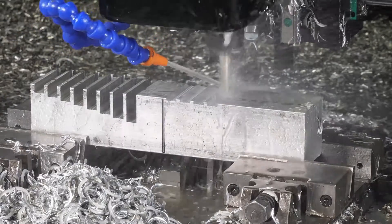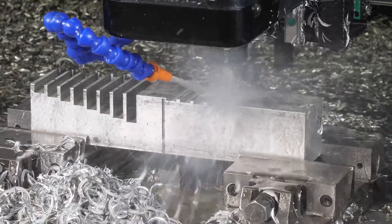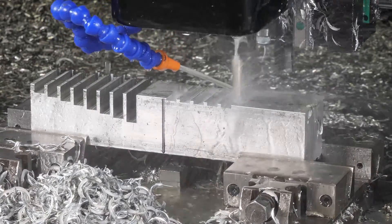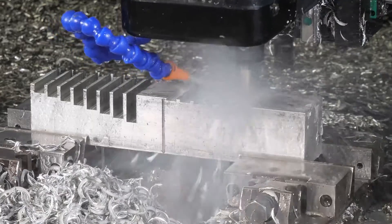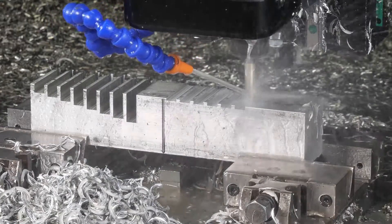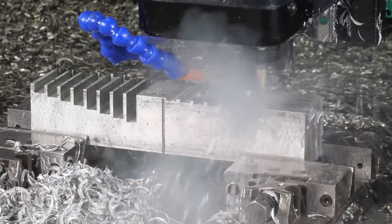For this video I wanted to compare two different machining strategies for slotting. In the first set of cuts, I wanted to go with the more traditional approach by selecting a slower feed rate but cutting deeper. For the second, I am going to use a shallower depth of cut but use the maximum travel speed of the machine when cutting.